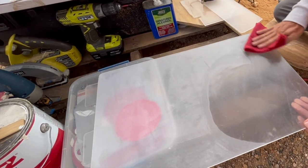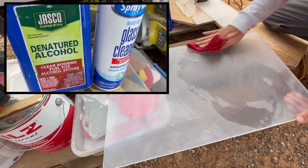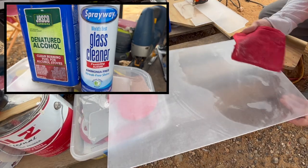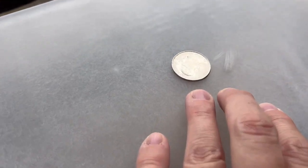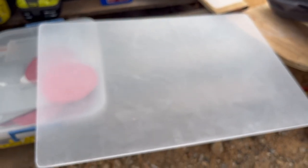Andrew is going to give me a little reprieve and see what denatured alcohol does to take some of that dust off. I've got a couple of blemishes I need to still sand out — I'm wondering if I want to even go finer than 150. I certainly have it.